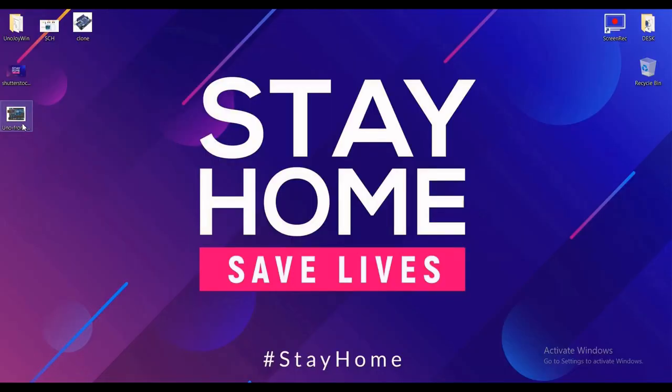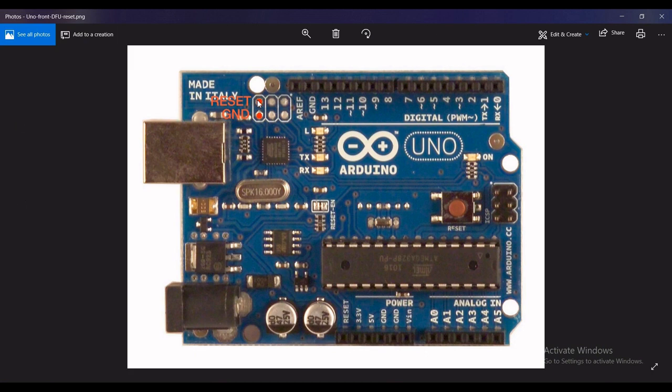The next thing to be done is upgrade the driver for the Uno. In order to upgrade the driver, you have to put it in DFU mode. This can be done by shorting the reset pins for around 1 second. Once the device is booted in DFU mode, you will be able to flash a custom firmware or update the driver.